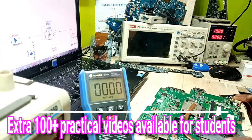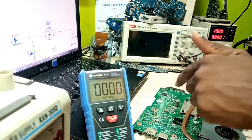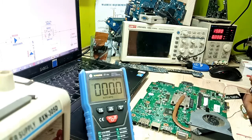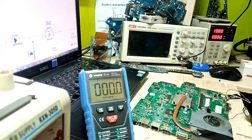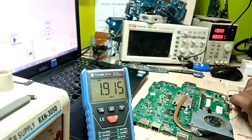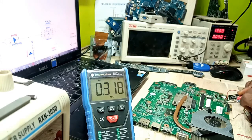The clue of this video: the AC OK signal is not proper — that was why the 5V was not generating. And if my AC OK is not generating, how is my 19V switching? Does that mean my MOSFET has shorted? Let's confirm. My MOSFET — is it short? 19V comes out direct without any permission. Let's check the impedance of the MOSFET.